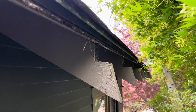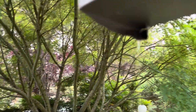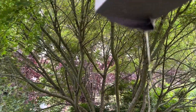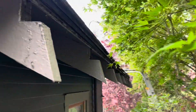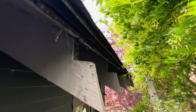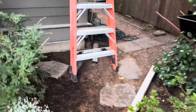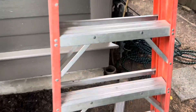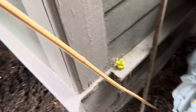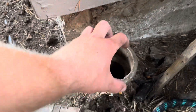That made the water stand inside the gutter — you can still see it's dripping. So we're going to notch these rafter tails and slope the gutter that way without cutting the gutter. We are also replacing all the downspouts.